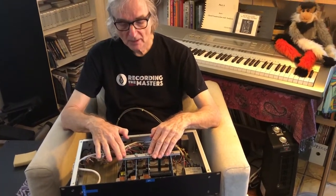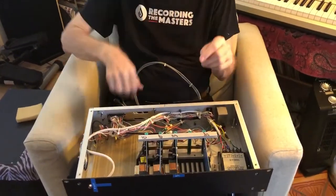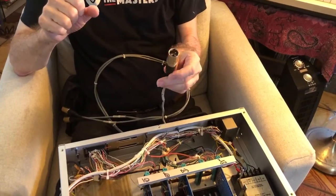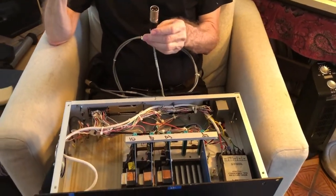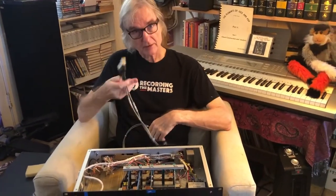So really what we have here is a dual-purpose rack. We have a bunch of inputs — actually at this point eight, but we're going to expand — going down to two left and right, with left and right outputs on XLRs. Then we have channel 3, which has about six inputs, so he can mix microphones through an API card — for kick drum or snare drum — and the main two are for stereo summing out of a DAW, coming out of the XLRs.